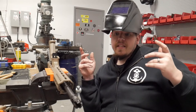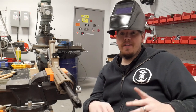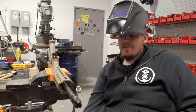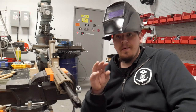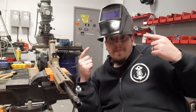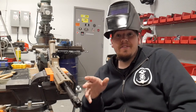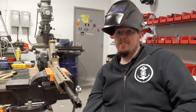We're at the point where we're going to weld this muzzle brake. Everyone has different preferences, but all you really need is a welder. Make sure you have the gas on if you're TIG welding, and keep the nozzle clean — make sure your pin is sharp with no bubbled-over metal on the point. You'll also need a welding helmet. I'm going to reposition the camera to get the best shot of welding the muzzle brake.